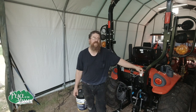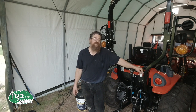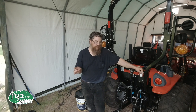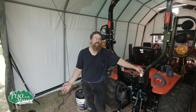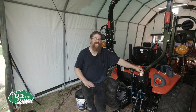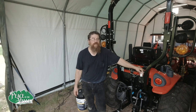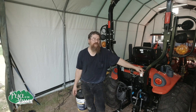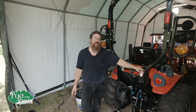Now, for newbies like me, I've never owned a tractor. I've had mowers, but something I want to point out here, before you get your tractor, there's a couple things you need to know. And one is, do not drive the tractor on the road in four-wheel drive. You may forget about it, but when you don't need four-wheel drive, take it off. Because when you're driving on the road, if you hear a high-pitched squeal noise, you're grinding your tires down. I'm not going to say that was from experience. Anyhow, don't let your tires be in four-wheel drive.